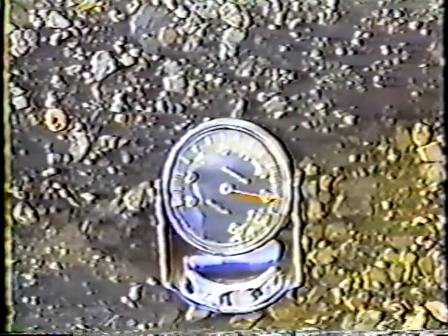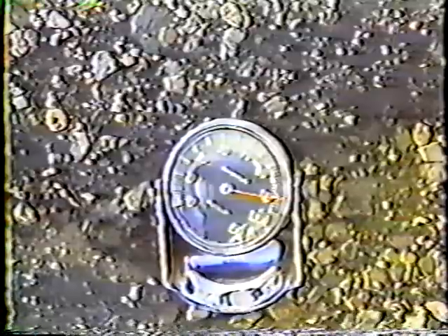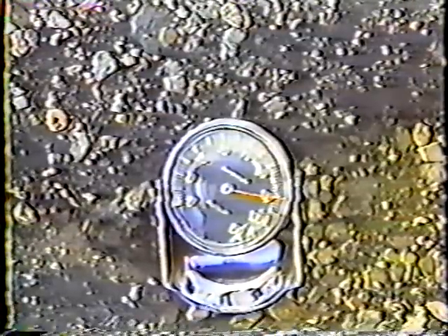On the morning of the day you're going to seal coat, with good weather and cover material ready, check the temperature of the road surface and the air temperature in the shade. Both temperatures have to be at least 70 degrees. If it's any cooler, the liquid asphalt won't set up and the cover material won't stay in place.